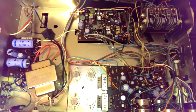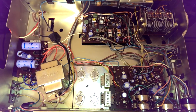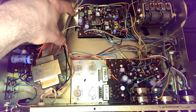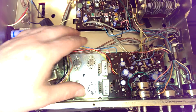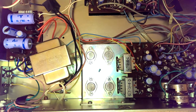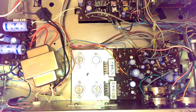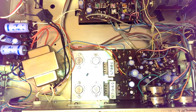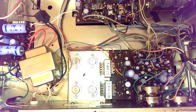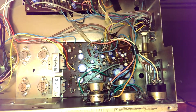That's all there is to this unit — a few boards and a lot of open space. If they'd had modern silicon they could have turned this into a powerhouse; you could put a nice big transformer there and some nice power boards with heat sinking, but the only heat sinking here is a little bracket that leads to the chassis. That's all it needs because it's not a powerful amplifier — only a few watts per channel, which is enough for background music in most rooms. It does come with its own set of speakers. Don't put other speakers with this unit — it wants 16-ohm speakers, and the amplifier won't be happy with 8-ohm speakers. It might overheat, and since it's germanium, it would be kind of expensive to fix. You might be able to adapt it to silicon, but just use the proper speakers.